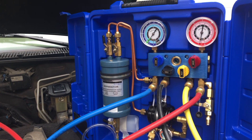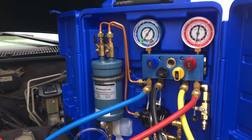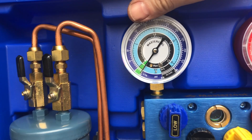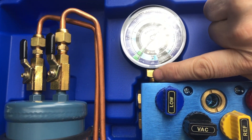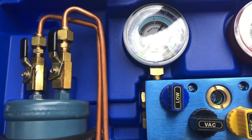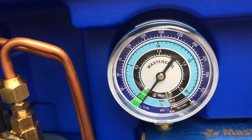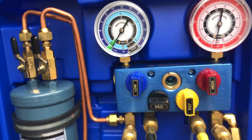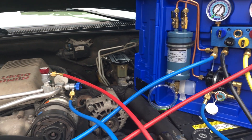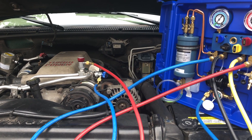In between videos I went ahead and popped the lens off and zeroed in the gauge, like I mentioned earlier that it was off. You can just get a little screwdriver — if you have this kind of unit, you see underneath there's a little notch where a screwdriver can fit in. Get a small dowel or piece of wood to use as a lever so you don't scratch up the anodized finish, pop the clear lens off, and use that little screw under the lens to adjust it. This applies to these particular MasterCool models like the 69500 and the 69000 recovery unit. If we're successful and don't have any leaks, we'll proceed to charge the system as normal. I hope this helps you out seeing this equipment in action. If you've got questions or comments leave them below; if you found this useful please hit that like button and consider subscribing.